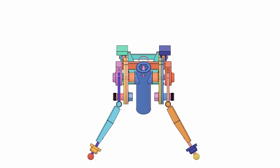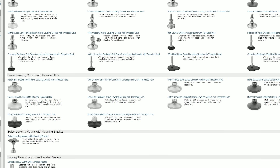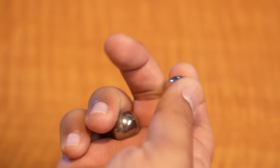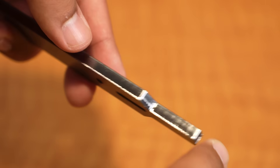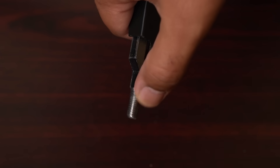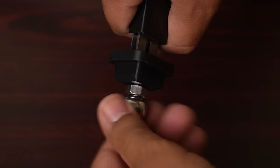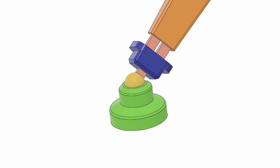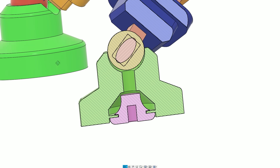Only one minor assembly for the front legs remains: the feet. While ball swivel feet are commercially available, there's far too much swivelage in the game model, and since that angle is too extreme for the foot industry, I had to make my own. Since a lot of stress would be put onto the front feet, I got some balls of steel with threaded holes. Since the legs are laser-cut plates, I can only have straight edges, which means the tips of the legs have to be rounded down so I could add threads with a die. Now I can slide this little foot collar on, then a nut, and then the balls hold everything in place. Since the angle of the ball foot is too acute to have a socket that mechanically holds the ball in place, I designed the foot to have a 6mm magnet to keep the feet attached. I also added some rubber foot inserts to each of the sockets for extra grip.